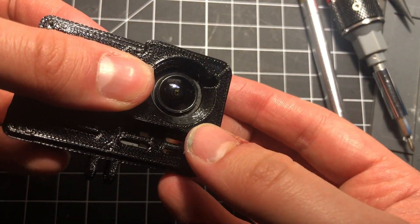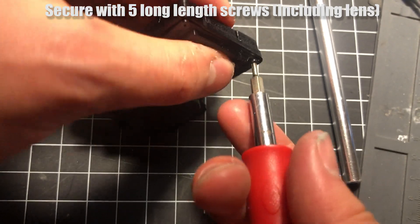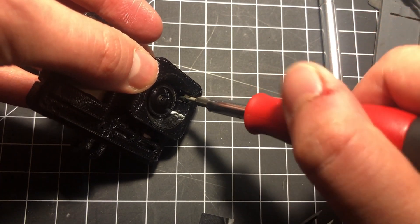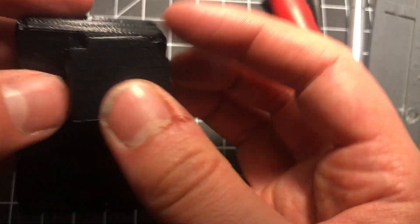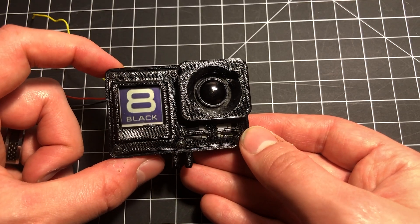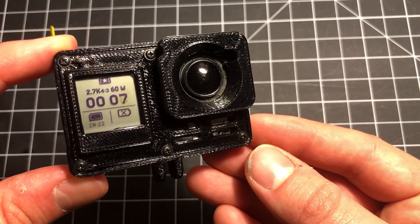We're in the home stretch. We're going to put the front of the 3D printed case on the unit. We've got five long length screws to go around the case, and that includes the lens — secure the lens with your screwdriver using Phillips head screws. Then take the 3D printed cover for the back of the lens sensor and connect your camera to a power source. I set mine to 12 volts. And boom — it should work! If you've gotten to this point and the camera's working and everything's all good, congratulations! You now have a naked GoPro Hero 8 Black.